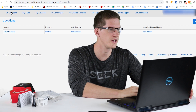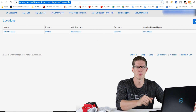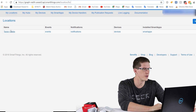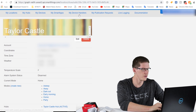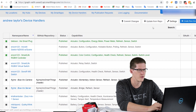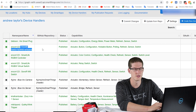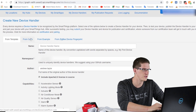You'll need to go to your SmartThings IDE, which is just graph.api.smartthings.com — that'll be the first link in the description. Once you go there, go to My Location, click on your location name after you sign in, and then go to My Device Handlers. From here, you'll want to create a new device handler. The one you'll want is the Inovelli Switch NZW30 with Scene — I already have it, but I will show you anyway.